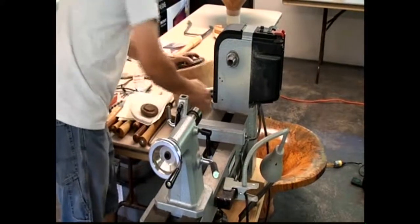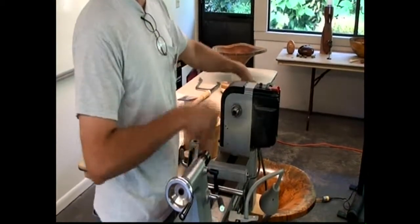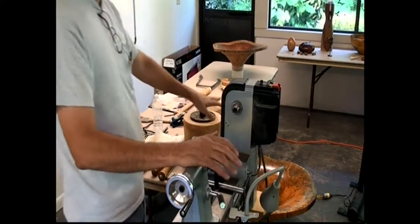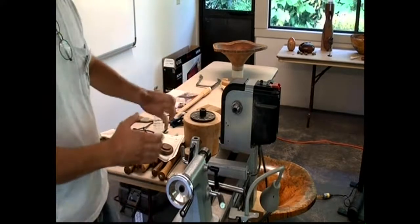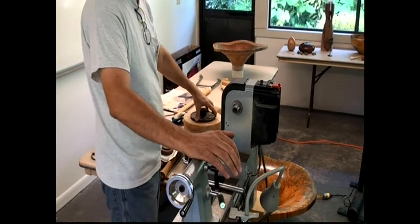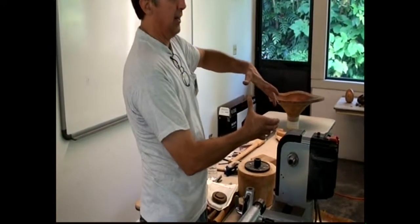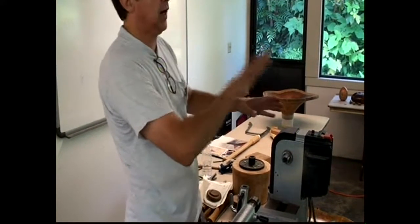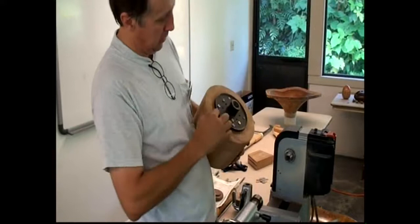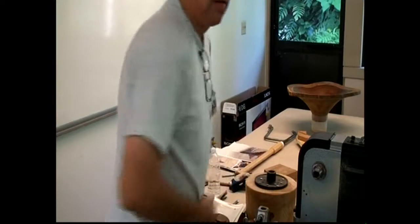Okay, I'm going to make one out of this piece of mahogany. Now that one I turned on my 20-inch Powermatic for the head slides. I mounted the faceplate on the bottom. I have a power planer, and I wanted the faceplate to sit really good. So I took the power planer and just really worked the center until I got the size of the faceplate perfectly flat, because the more contact, the stronger the hold is. When you're putting screws in there, you want that sitting as flat as possible, especially for something that size. How much did it weigh, Lee?